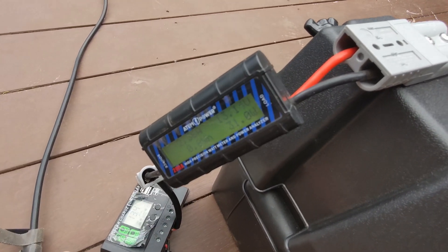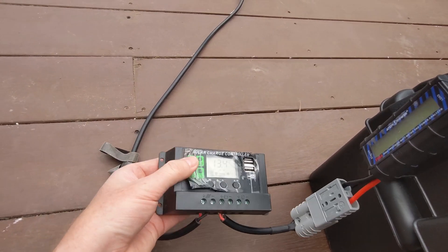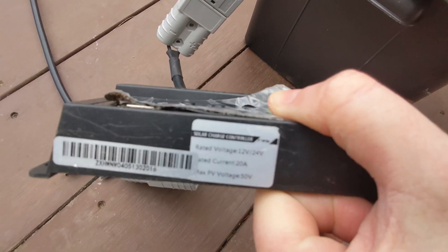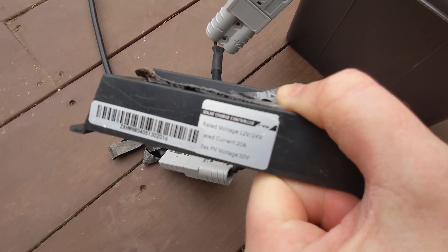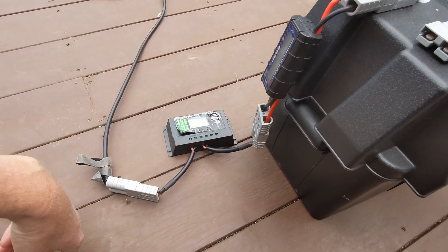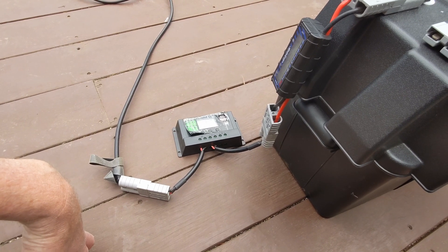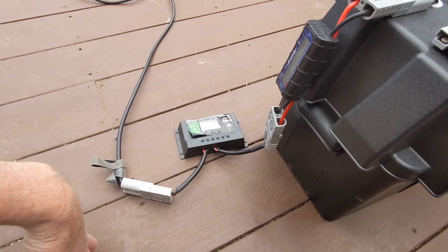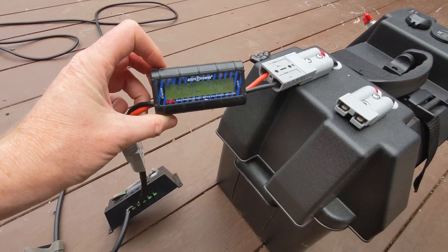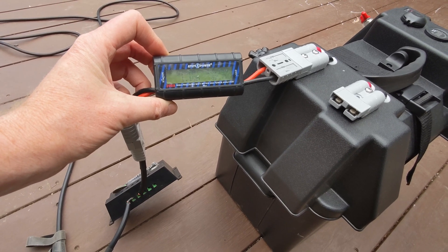It's not pumping out too much at the moment, but you can see my poor old PWM controller here has gotten fairly beaten up in the meantime. Even on basic PWM controllers you can see there's a max PV input voltage value of 50 volts — and that's just on the included cheapo PWM. So I found it a bit surprising that a $50 MPPT didn't have any such specs with it. We'll let this run for maybe half an hour and come back to check what the maximum amperage feed-in and maximum wattage gets up to.